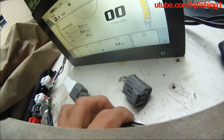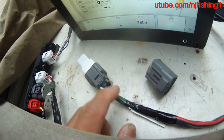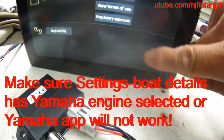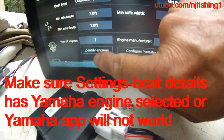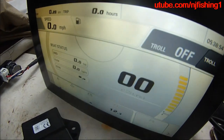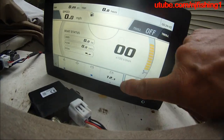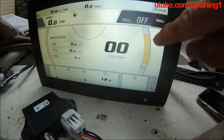I'm going to return this inline port - you don't need it. This bus wire, you don't need it. You don't need two caps, you just need one, and then it will work. You go to settings, port detail, and then Yamaha. It took about two minutes for Raymarine to recognize the entire engine data. Once it's activated, engine data will flash like that.